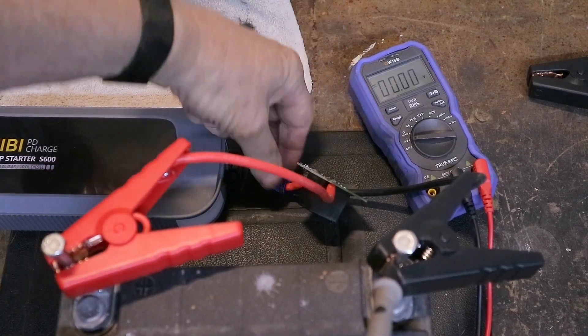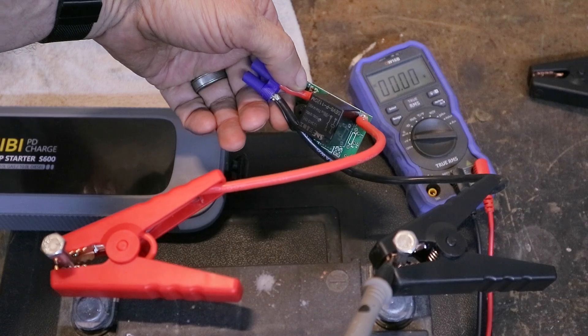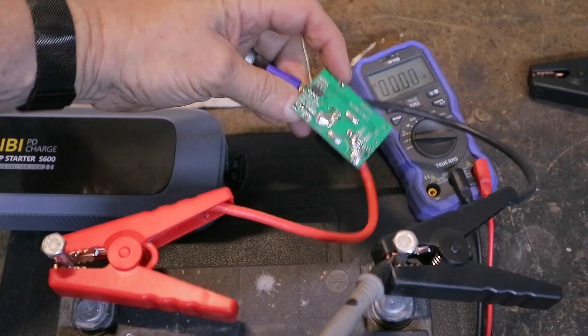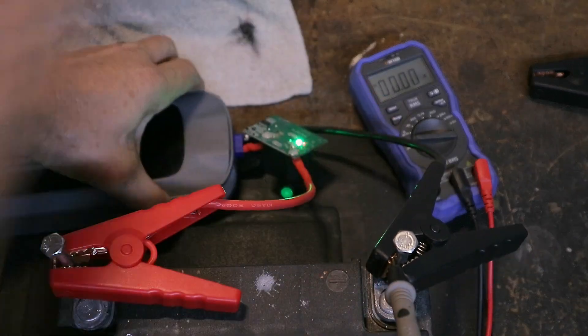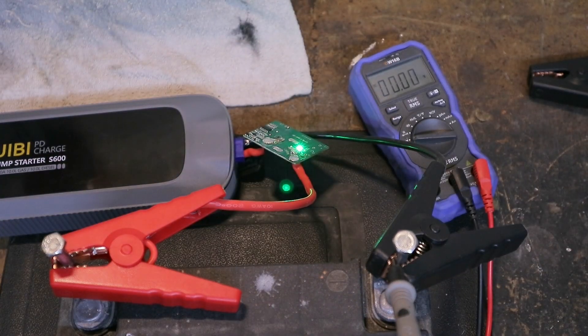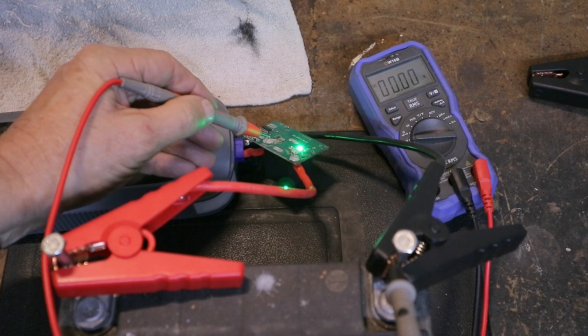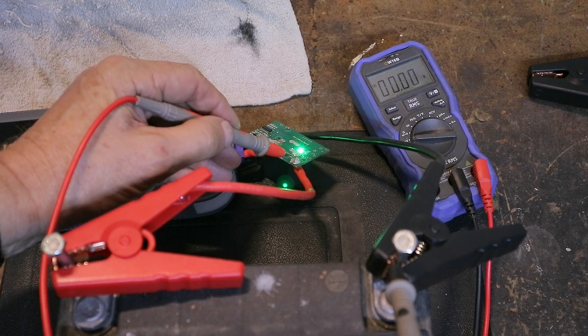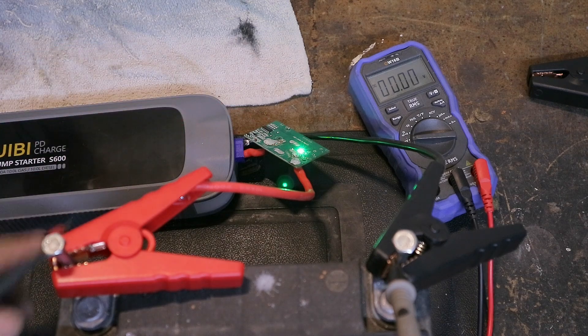Here is that little board itself. You can see how it works - the red wire goes through the relay, the ground wire just goes straight. When I plug this in, it turns green - it believes it's connected. I should have 16 volts at the positive cable and I do not. If I check back here, I got my 16 volts there. But if I come to the output of that relay, I do not have it and I should. Without it getting through, it's not working - even though the relay is making all the correct sounds. So either this is a defective relay or something's broken somewhere along the way.